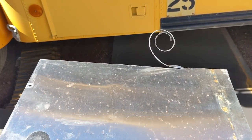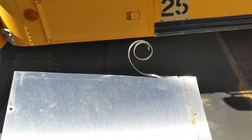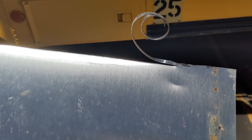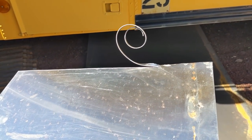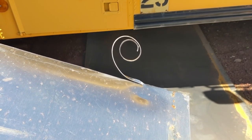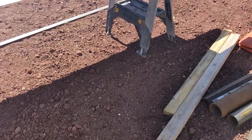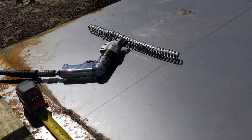I did say those shears work just fine for 18 gauge steel. That is mild steel. A friend of mine that's visiting with his ambulance to do some work used the shears to cut some 18 gauge stainless, which is a lot harder, and it actually snapped the blade. It's easy to get replacement blades, so it's no big deal, but just keep in mind when I'm talking about cutting 18 gauge steel with those shears, it's with these shears and just mild carbon steel.